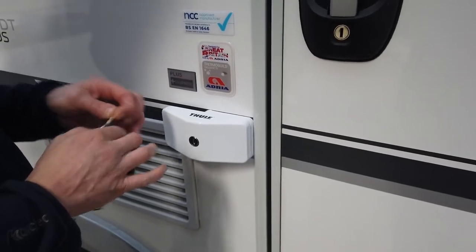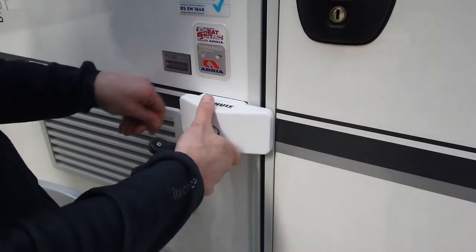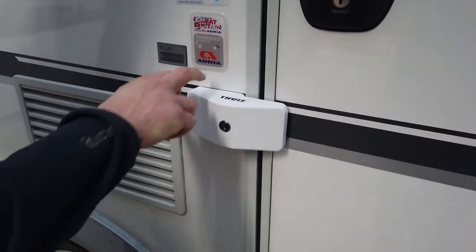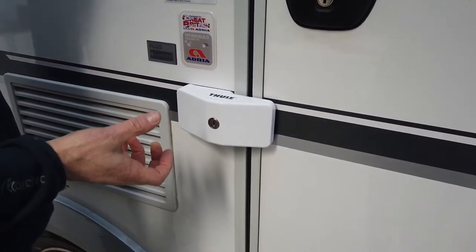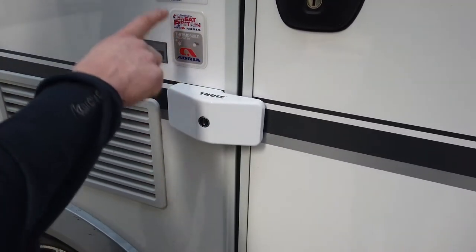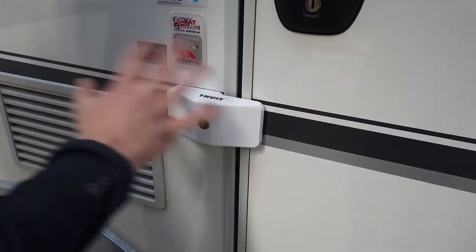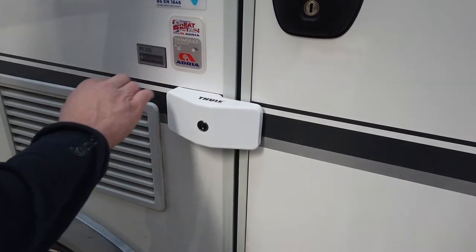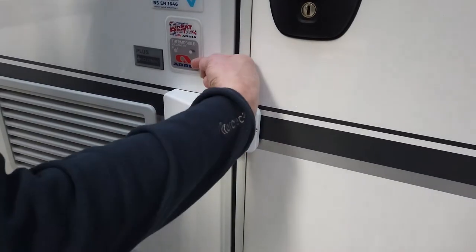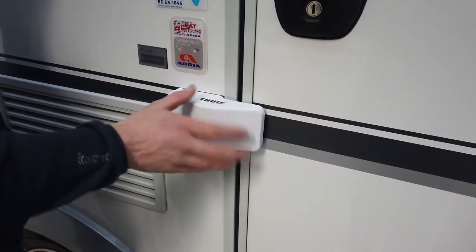When you're ready to lock it again and leaving for the day, just put the key in and slide like so, then push the door lock home. We've fitted it with a nut and bolt on both sides, with a blanking panel so you don't see any ugliness inside. Not every installation would allow you to get to the other side — it could be a fridge, cooker, or electric cupboard. If you do have access, that is the most secure way. The other fitting option is a nail bracket that bolts onto the frame, but it doesn't look as refined.